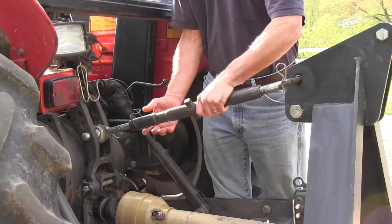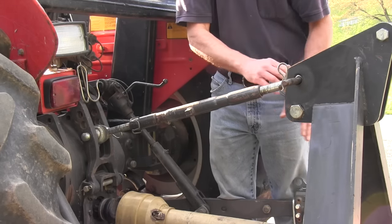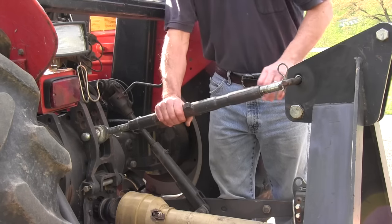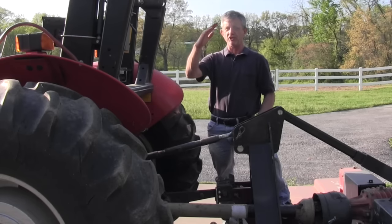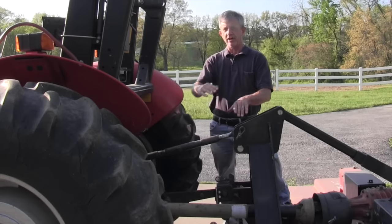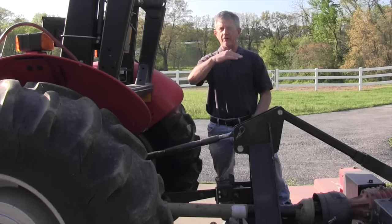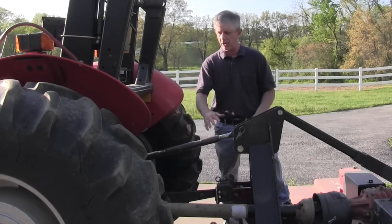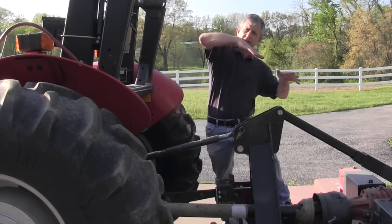I'm going to do what the owner's manual recommends and put it in that lower hole, just firm tight. The owner's manual says it's okay for the lower link arms to come up a couple of inches before the top link catches and pulls up the tail wheels. Then set it so the top link won't move around from vibration while operating. At this point, the top link only has two functions: it works with the lower link arms to pick up the machine, and it catches the back tail wheels if you back off a grade so they don't drop down the hill — which could put your PTO shaft in a real bind. As you back off a hill, the top link holds everything steady, and as the tractor's rear wheels come down the grade, everything levels out.